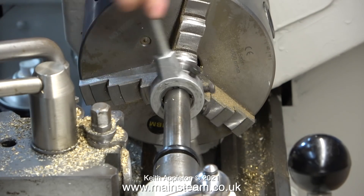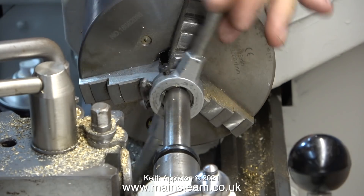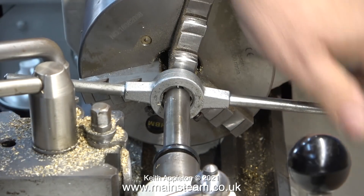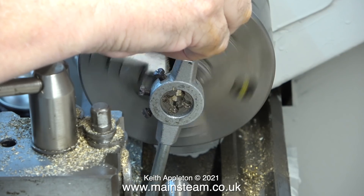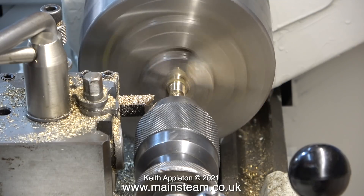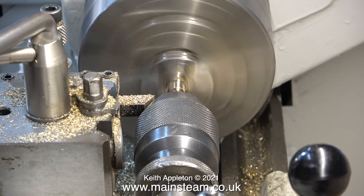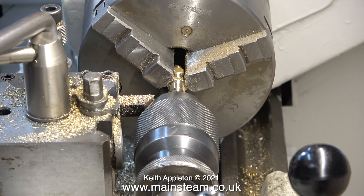Once again, from a different viewpoint, I'm using a tailstock die holder part that fits in the tailstock quill to make sure that the die is perfectly square to the work when threading it. The lathe is in back gear for this process, so when finished I put it in reverse, hold the handle of the die holder, and remove it. Now just like on the other end I'm using a center drill and drilling the part deeply — it's worth remembering that the tip of this center drill will not break through into the hole of the other center at the other side.